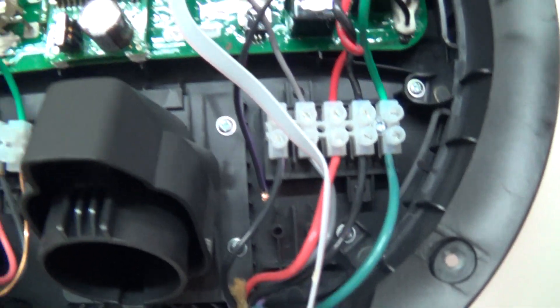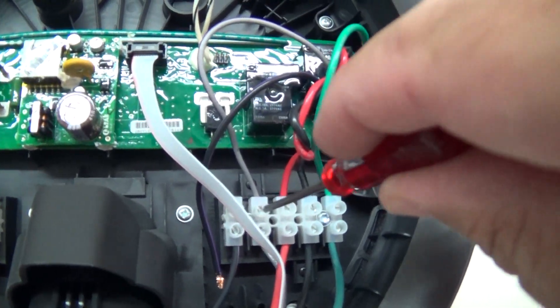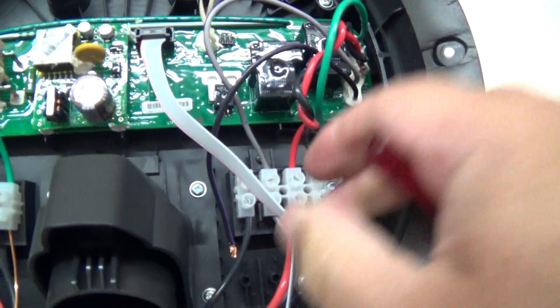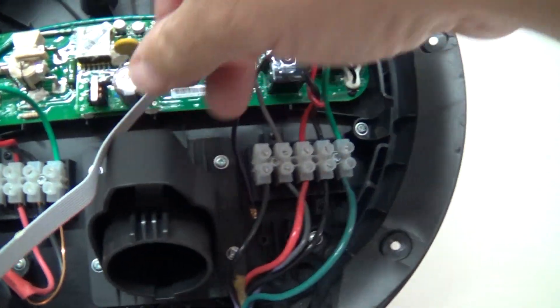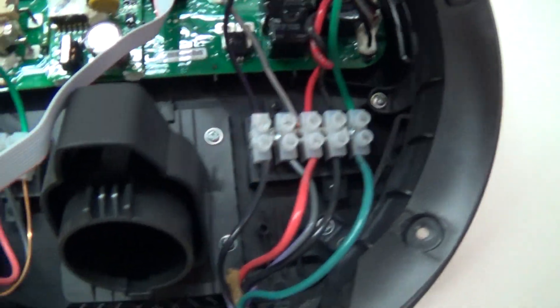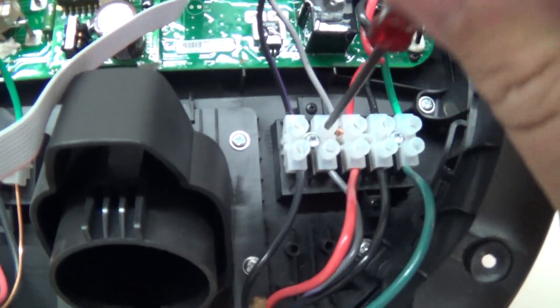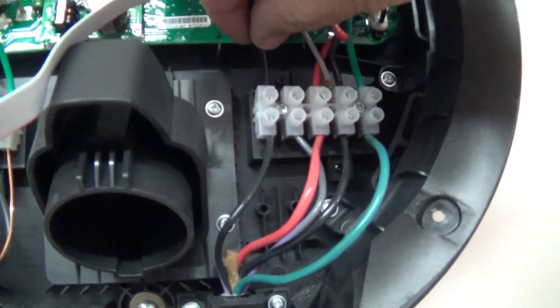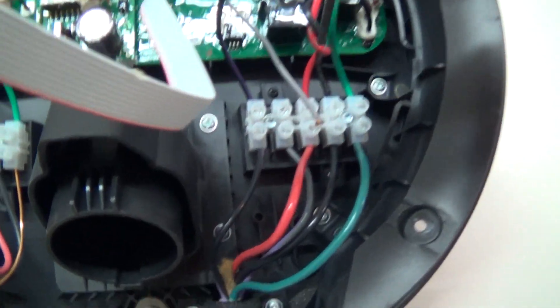Contrary to what people think, these are actually not a charger. They do have some circuitry in them — it's just ground fault sensing and protection circuitry. This circuitry has got nothing to do with charging the vehicle whatsoever. The charger is actually on board in the car. All this circuitry does is verify that it's safe to charge: that the voltage is within specification, that the grounding is good, there are no ground faults, and that the car is ready to accept the charge. The grey and black leads communicate with the car — it's just a go/no-go signal.